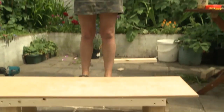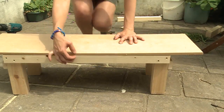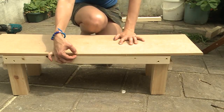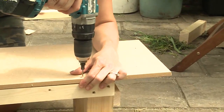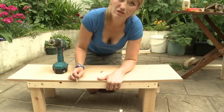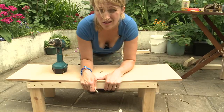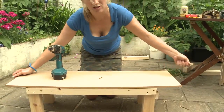We're going to fit the lid to our frame. And how we're going to do that is basically the same way. Although with our countersink, because this is thinner, we're not going to go as deep. See, just a little bit. It didn't go in as deeply for this one. I'm going to screw it in 3 for the long and 2 for the short, purely for the basis of keeping it on, so that if somebody lifts it from either end, it doesn't pop out.